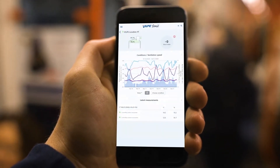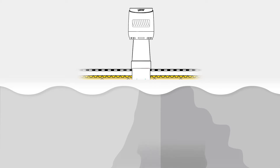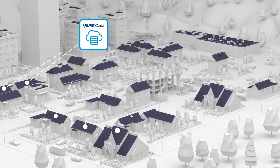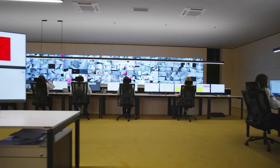Vilpe Sense detects and prevents moisture damage in the crawlspace. The system reacts to increases in humidity by increasing the ventilation in the crawlspace. By quickly removing moisture, additional damage can be avoided. The faster hidden damage is detected, the easier and cheaper it will be to repair.